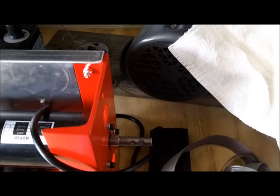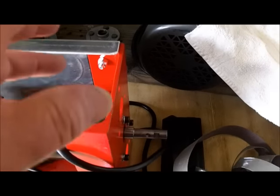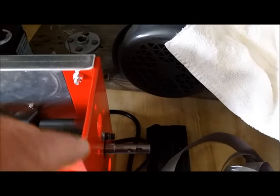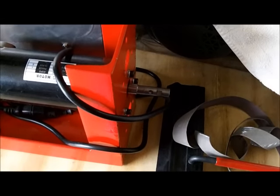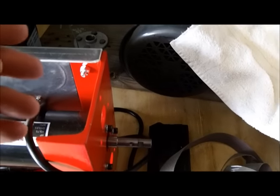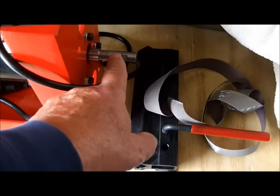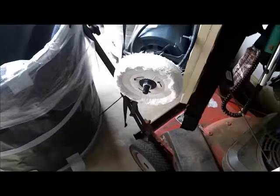If you get my picture. I'm going to put a 2x6 on top of this plywood, and the mandrel will be mounted on that, so it'll be free from any objects. And I'm going to run it with a belt. And if I don't want to use it, I'll have the thing maybe on a spring, on a hinge or something, to be able to take the belt off and put my different doodad adapters that I have for this shaft on here and use my tray if I have to. That way I can eliminate this buffer here.